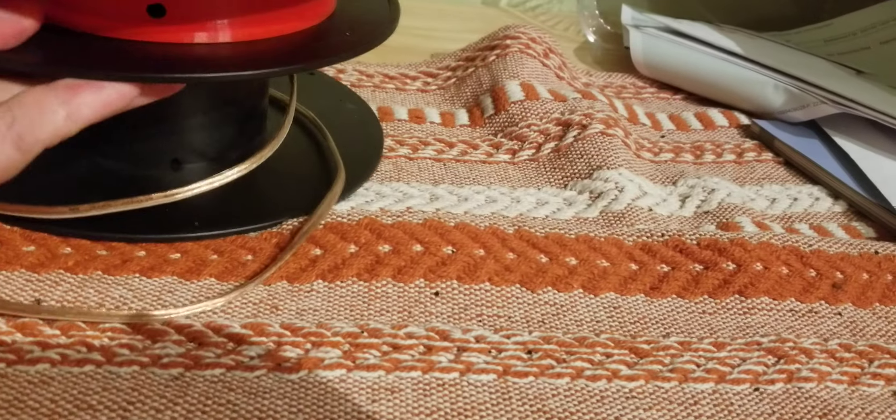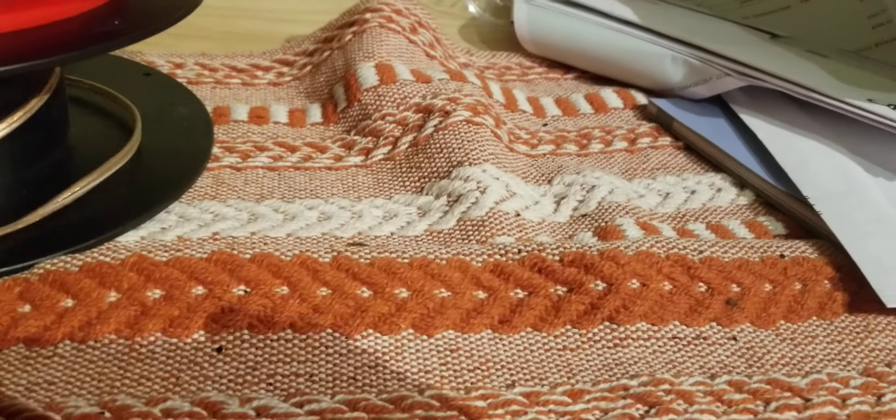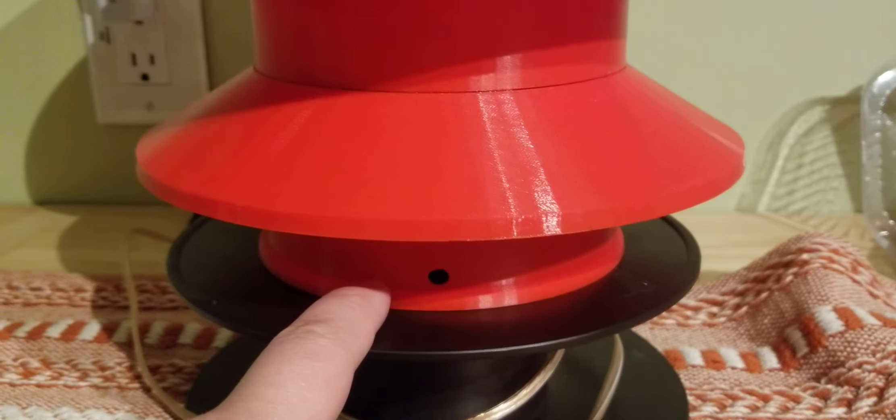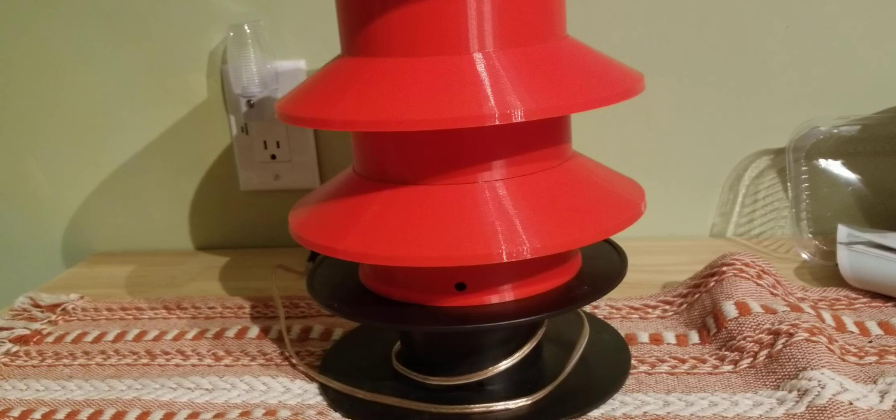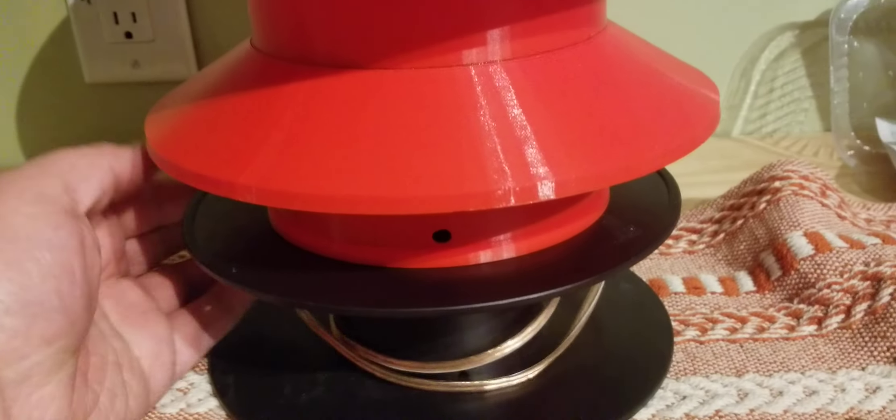Back to the actual siren — it went together pretty good. I can make another video explaining the hardware, but besides M3, M4, and number 10 screws there's really not much to it. You'll want to find a motor with about a 2.3 millimeter shaft — that's what I like to use for these. I get it on Amazon and just buy it every time. It's got bronze bushings instead of ball bearings but it works fine. I use an aluminum shaft coupler that's 25 millimeters long with two set screws on each end, and I just make the chopper press-fit onto it — works perfectly fine and you can take it off later too.